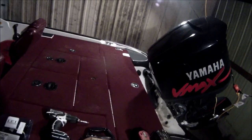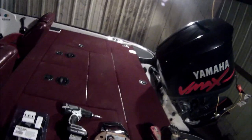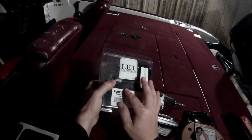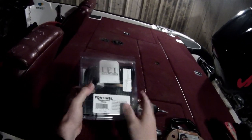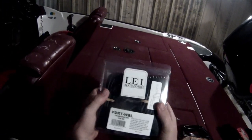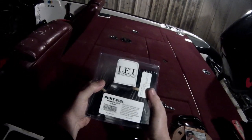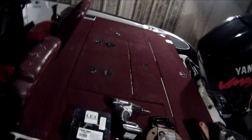You need to keep the surface a little rough because you're going to need that roughness to get the epoxy to adhere to it. The same goes for the transducer — the bottom of it is real slick, so we'll want to rough it up with sandpaper as well to allow the epoxy to adhere. It does come with the epoxy included, so you don't have to purchase any unless you prefer a certain brand.